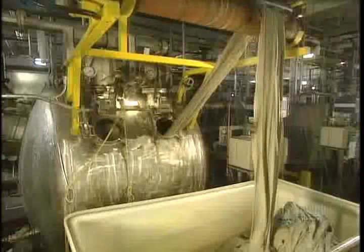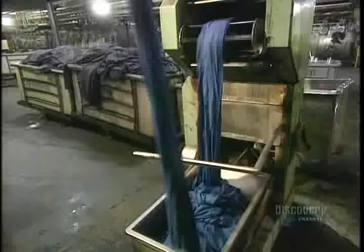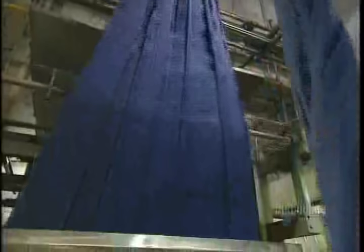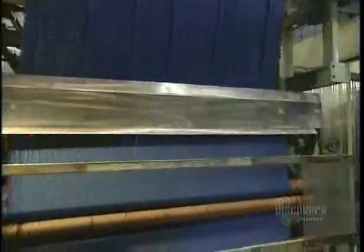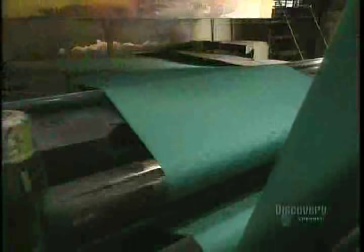The solution is heated and the fabric soaks for about 6 hours, then it is rinsed in lukewarm water. The fabric is placed in a bin and fed into a machine called an opener, which unfolds and stretches the material before rolling it up on an immense roller. From there, it moves to thermosetting in a high-temperature oven at 200 degrees centigrade, where the fabric circulates for 45 seconds.